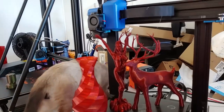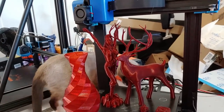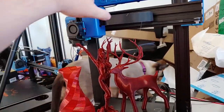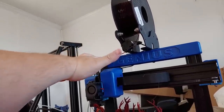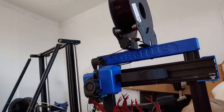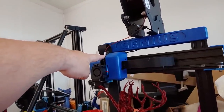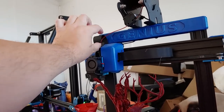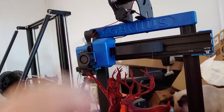The fans are excellent — I have zero complaints. They did a good job. I still don't like the filament runout sensor placement, though — if the filament breaks somewhere between the sensor and the hot end, it's not going to detect it and not going to stop the print. I'd like to see the runout sensor moved closer to the hot end, although I can see that being a design challenge because the filament path would create a tight angle.